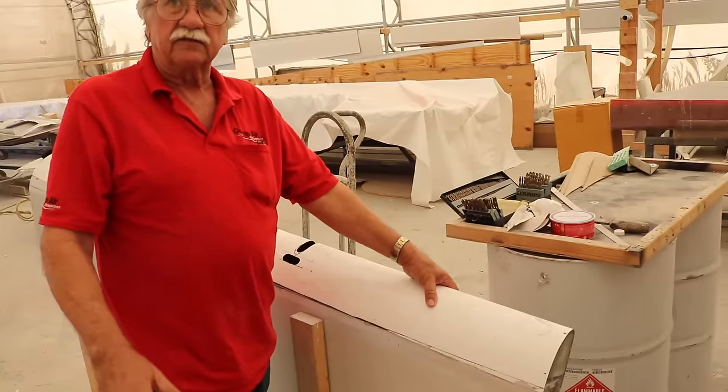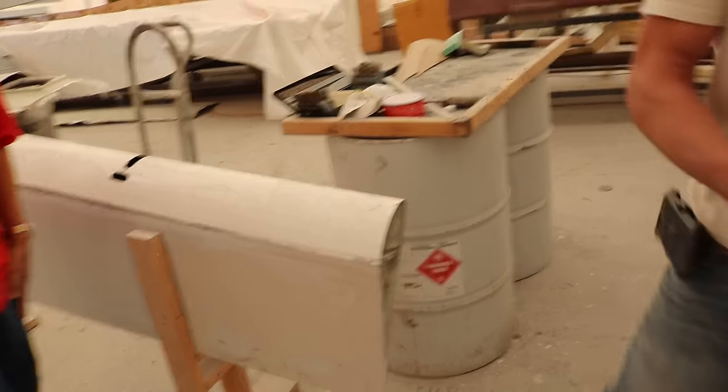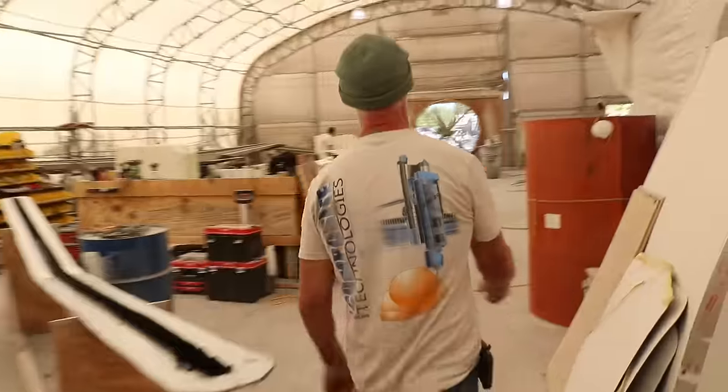In the wing, because the wing has the same feature that it's hollow, it allows for de-icing, easy installation of de-icing, and wire chase. You can just run the wires on the leading edge. Let me show them that real quick. It's a lot more damage tolerant.